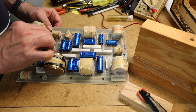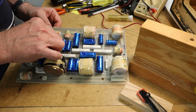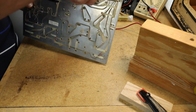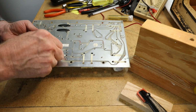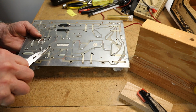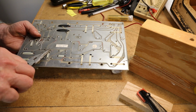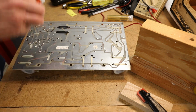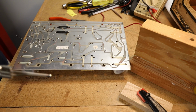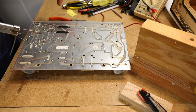You can purchase these replacement capacitors from Falcon Acoustics in the UK. My husband had to contact them to ask a few questions about the caps, and they were very helpful. Most of the old capacitors are rated at 50 volts. The new replacements are rated at 100 volts. All these new capacitors meet the specifications by KEF. I assisted my husband by doing all the soldering on the second board. It was a great learning experience.